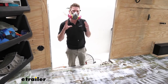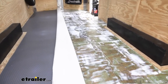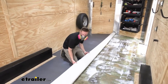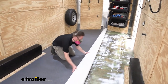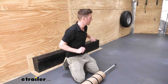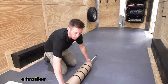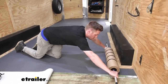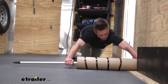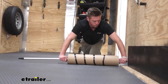Now that the glue is down, we're going to let it sit for a little bit. We want it to get tacky but not glossed over — we don't want it to dry. Keep a close eye on it; wait about 15 minutes or so, and then you can go ahead and roll it back out. Now that it's nice and tacky, start rolling everything back into place. Take your roller and go one direction, then do the other direction. The heavier the roller, the easier it'll be — mine's about 70 pounds so I'm putting a little more force down on it to get it nice and stuck to the glue.